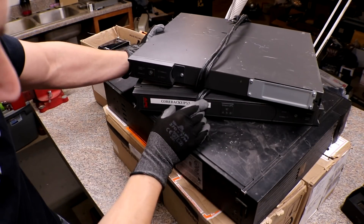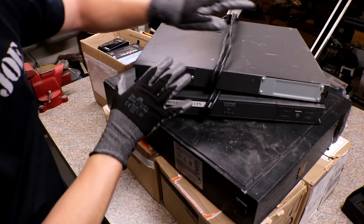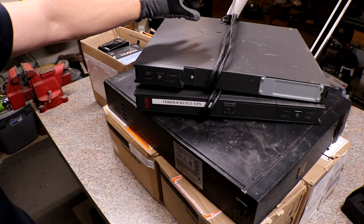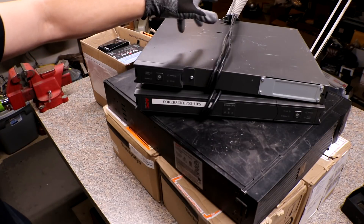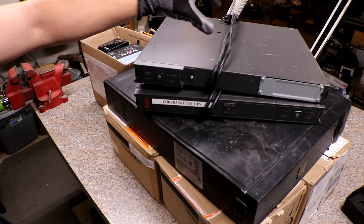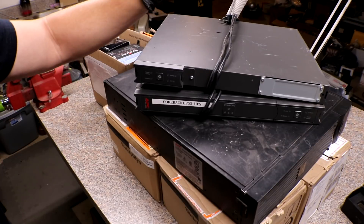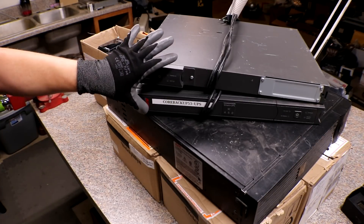On the top here I have two Smart SC 450 UPS units. I got these so I can practice the circuitry inside — NerualNar did that whole thing where he was able to series two of them together, and I want to attempt that. If I let the magic smoke out, that's okay. If I'm successful at making one a slave, I'll plug the slave into the other to see if I can parallel them, giving me 900 VA between both instead of 450 at 220V. I told my recycler I'd most likely blow these up and bring them back.